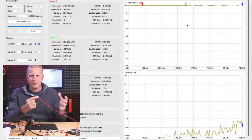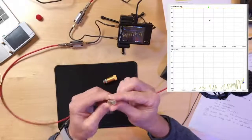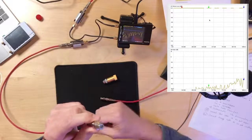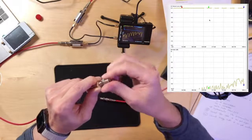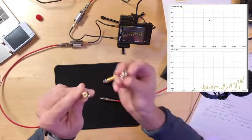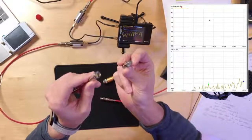What's on the end of your cable? Is that an F81, or is it just open? Yeah, that's just an F connector, a barrel F connector. All right, yep. So what happens if you take the F81 barrel off? A lot of people say, you know, unterminated. Still just as bad. Yeah, so a barrel is not a terminator.